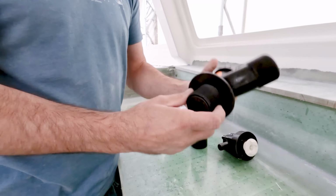Okay. So this is how we learn. Cut it first a little bit closer to where we need the final area, because regardless of how I held the grinder, it was flinging stuff everywhere. So there's melted plastic all over the place. Luckily, it comes right off the gel coat because that is still fairly waxed. So not a problem there at all. I am covered in it. And then I have to do a final sand just to get this kind of melted stuff where it actually did stick to it. But you can see it is perfectly flush when in a closed position now.